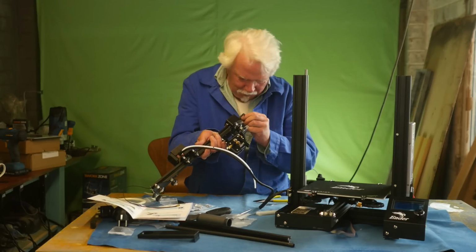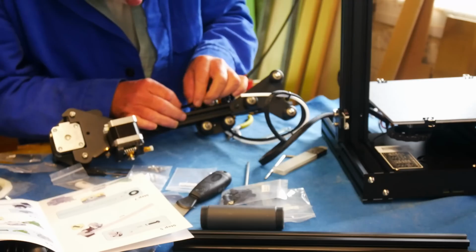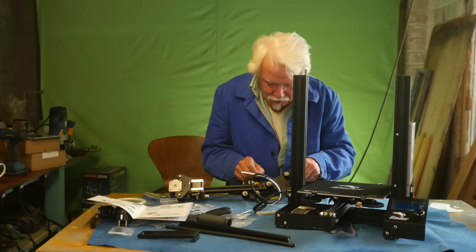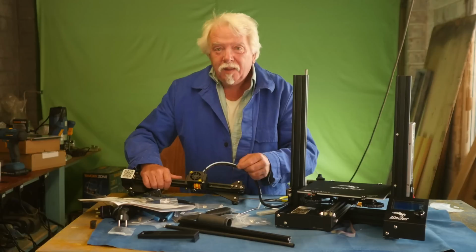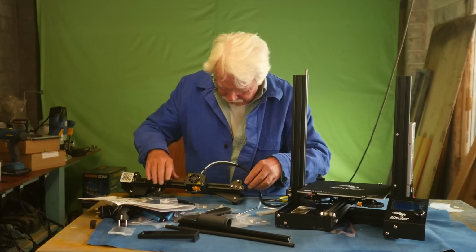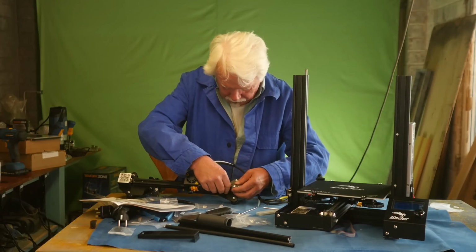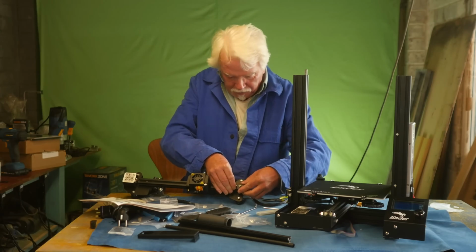That has to go through underneath and fit into that slot there. And then the other end, a bit easier at this point because there's nothing for it to go around yet. Okay, so this fits on with all those funny little angled nuts that go inside the groove, and so I've wrapped the timing belt around it, and now what you need to do is position that so it's gonna tension the belt.